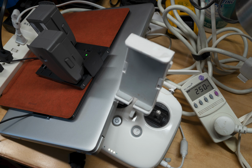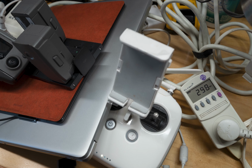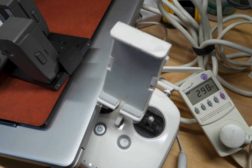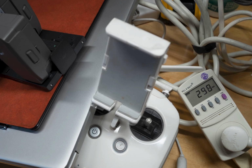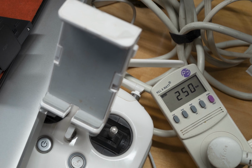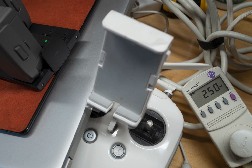Add a second Mavic battery, and the cost doesn't really change because again, smart charger. It charges the batteries sequentially, not at the same time. Add the Mavic controller though, and we peak out with an additional 47 watts, total 298. That's close enough to the 300 watt max. This did settle back down to 250 watts, probably the pre-charge on the cap, bringing it up to charge.